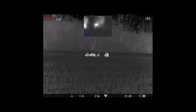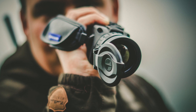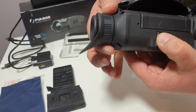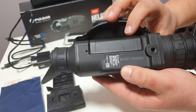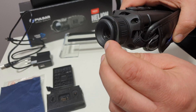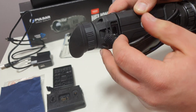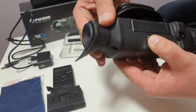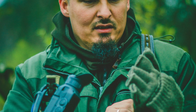All recordings which you can see here come directly from this device and from several hunting trips in which I've been using it. An interesting fact is that we can record with and without sound. Below the buttons is the ring for adjusting the eyepiece focus. On the side there is a heatsink and at the bottom there is a mount for a photo tripod. On the other side next to the battery is a micro USB socket for connecting the imager to a computer. The device is equipped with 8 gigabytes of memory, which is enough for many hours of recording. The device is completely waterproof and withstands use in snowy, foggy and rainy weather.